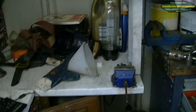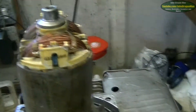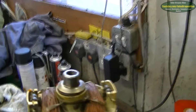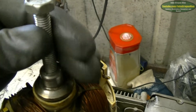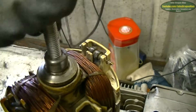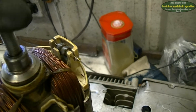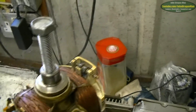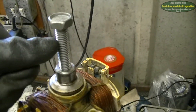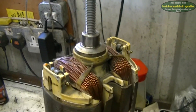First I've got to cut the thread. I haven't got any proper cutting oil, so I'll just use some engine oil from the crankcase of this engine. My thread is cut and my bolt screws in there nicely. It threads in to about that far down — that's the longest I could do thread-wise. Hopefully that's enough to get the thing off.